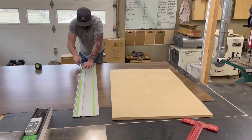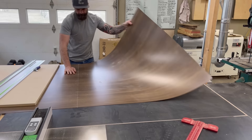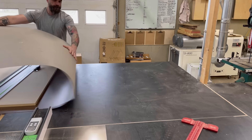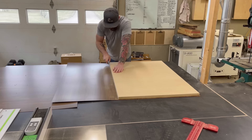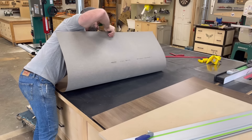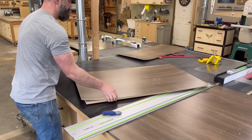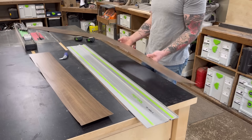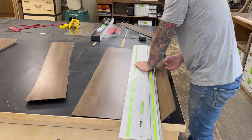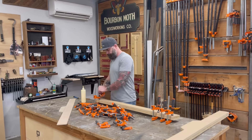Once you etch your line exactly where you want it, it's as simple as folding the laminate over until — snap — it breaks. If you score it correctly, you can get good, crisp, clean edges. Of course, I'm cutting all my pieces a little bit bigger than they need to be so they overhang my MDF, and once attached we'll come back with a flush trim router bit and clean it all up. Score, score, snap — it's really that easy and quite satisfying. Sometimes when I'm bored I come out to the shop and just break apart pieces of laminate just for the fun of it. Maybe you will too after this video.